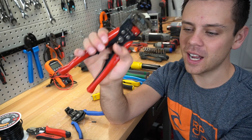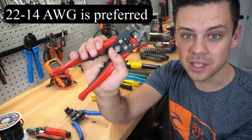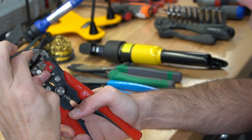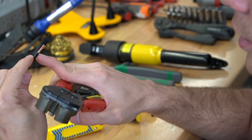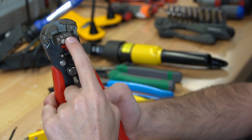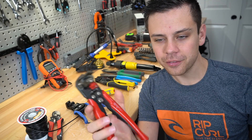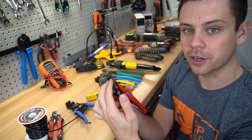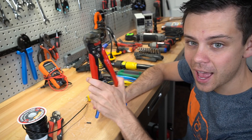Next we have these wire strippers. I do not like using these for most jobs, but if you have very small wires like balance leads, these work great. You stick the wire in here, press down on the top so it grips it, and then squeeze — though sometimes it can hurt the conductor. These are great for very weird cables, strange shapes, or multiple conductors in a single sheath, like when I stripped Cat 6 cable. Another benefit is you can strip multiple wires at the same time — I'll put like three or four in there for a balance lead on a 48 volt system.